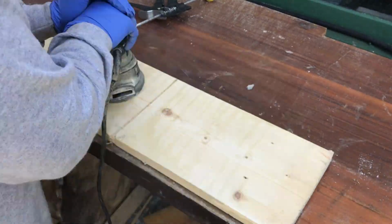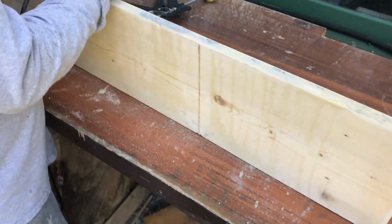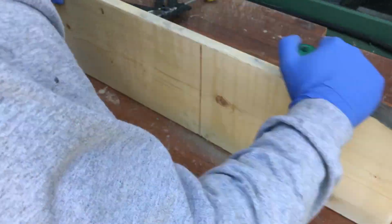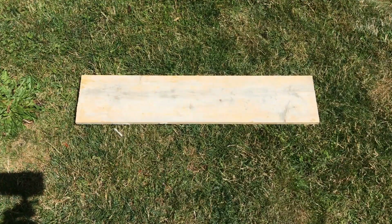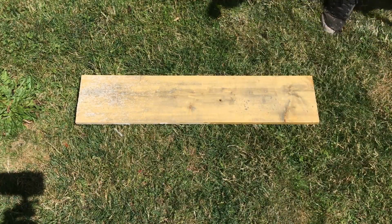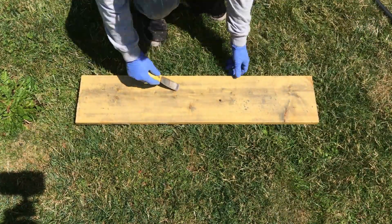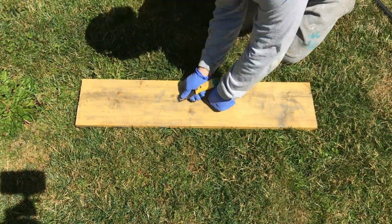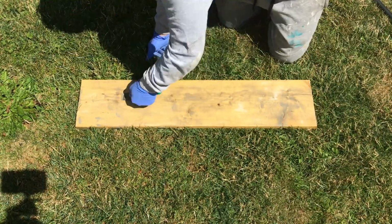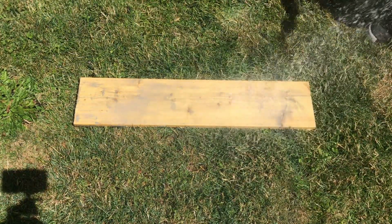And even if you don't have any power tools at all, providing there isn't too much concrete residue on your wood, you can still use my third method, which is just wet your wood down with some water, whip that same putty knife out, and scrape off the residue. Then when you're all finished scraping, give it a quick rinse and voila!